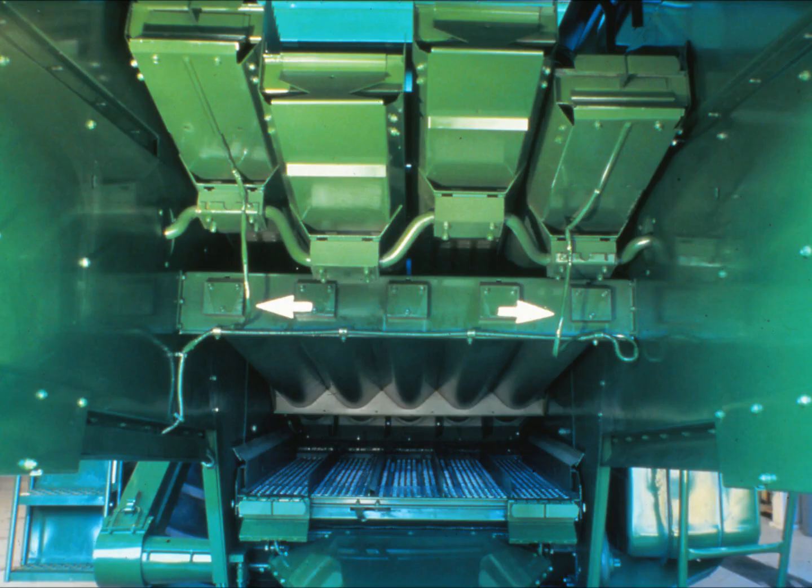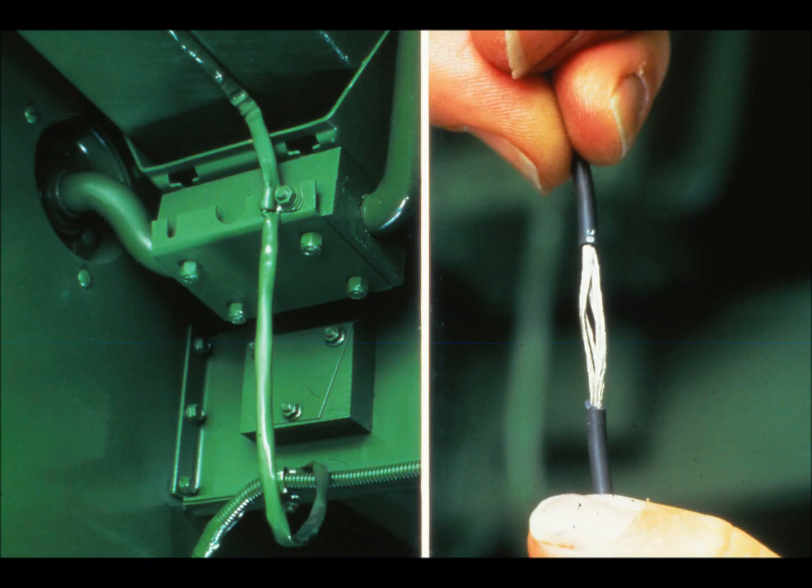From the sensors, the signals pass through the first of the three wiring harnesses to the preamp. This is a special type of marine braid rope lay wire, which cannot be repaired. If damaged, it must be replaced as a complete unit. Instead of a single wire of a certain gauge, this braid wire is composed of many fine wire filaments, used for both flexibility and more reliability. It won't break, but if sheared off, it cannot be soldered back together and so must be replaced.